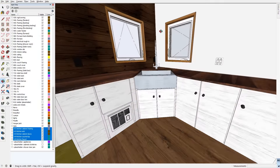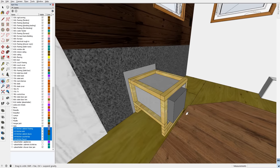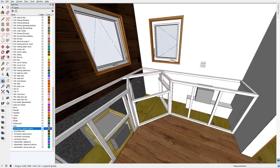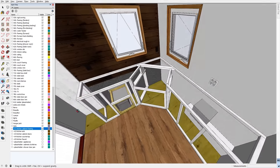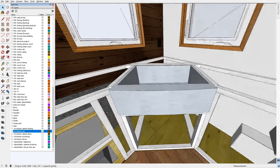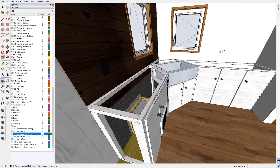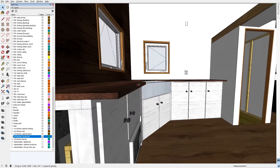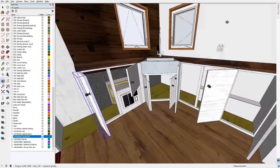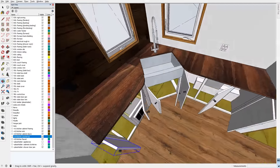Because we have a lot of things to work around — like the water heater, some plumbing, and the furnace — we've decided to frame a skeleton instead of building traditional cabinets. We're also doing that because the farmhouse sink needs to be supported from below. You'll notice there aren't any drawers; that's because we decided to go with an overhang countertop, so we'll just have cabinet doors that open into a cavity and add shelves as needed.